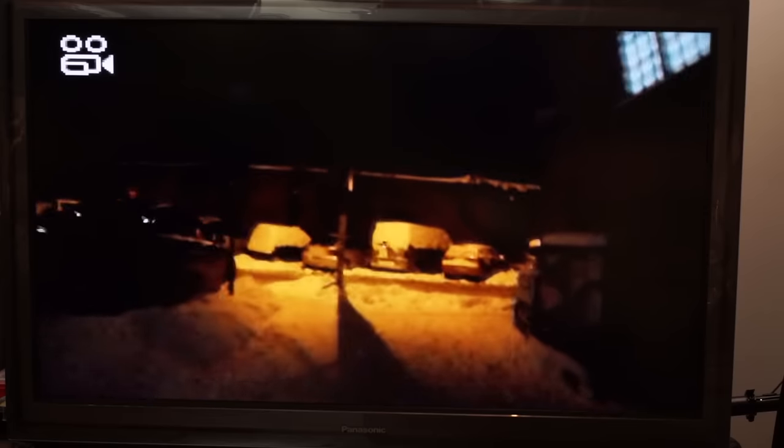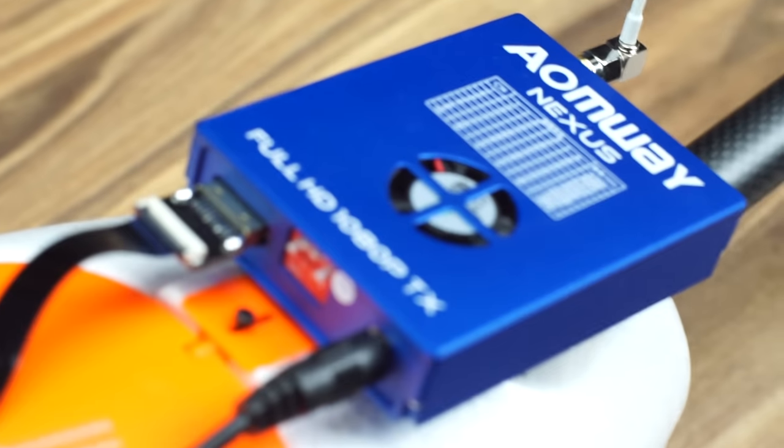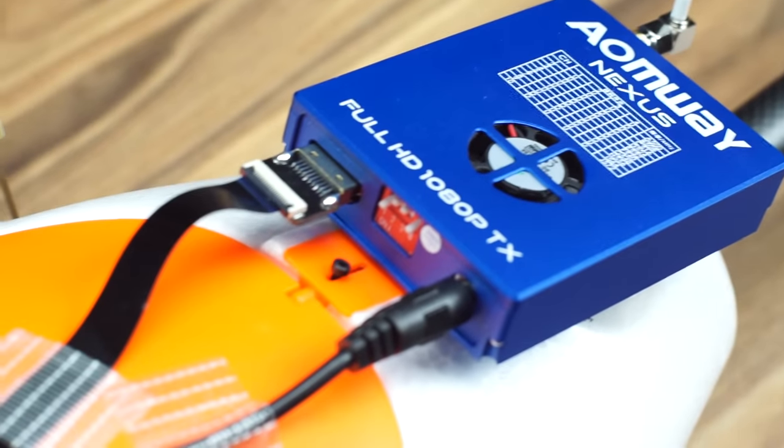Diagonally through the whole building with the antennas I made for around 572 megahertz, I was getting a pretty good signal with some interference — but that's through an entire building made of bricks and reinforced concrete, so I'd say that's pretty good performance. Next I walked around the block, and it went through one building — probably helped by reflections — but didn't cope well with two buildings. Signal was lost when I walked behind the second building, but when I reached the far point, signal came back. Pushing through a whole building when I can't do that on 5.8 GHz with a directional antenna was really impressive.